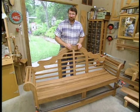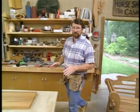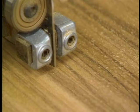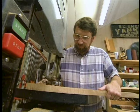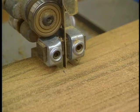The back of the bench is perhaps the most distinctive element. It's made up of two pieces — they're mirror images of one another and they're not bad to make. I laid out the pattern on some poster board and then transferred it to my blank of wood. Now it's back to the bandsaw. I like to make a series of cuts along the inside radius areas so that it relieves any pressure as I make the final cut.